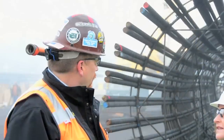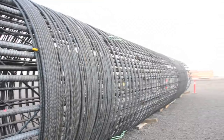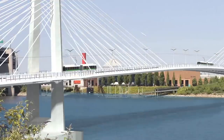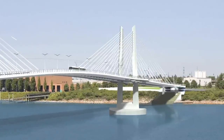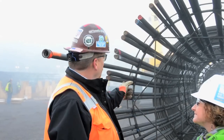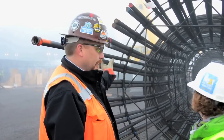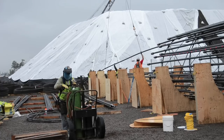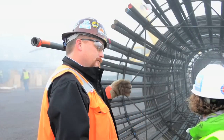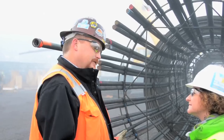These cages are huge. This is the cage for T3 and T4 — T3 is tower three on the west side of the river and T4 is the tower on the east side of the river. There are six shafts per footing per tower, with two towers coming out of a foundation. These are 9-foot-10-inch diameter concrete structures. The rebar cage has six inches of clearance all around for concrete to consolidate, so the cage itself is 8 foot 10 inches. They're 165 feet long for tower three and about 174 feet long for tower four, and they weigh about 60 tons of steel.